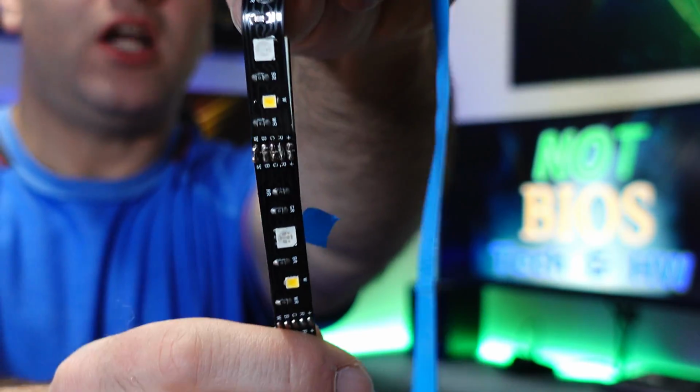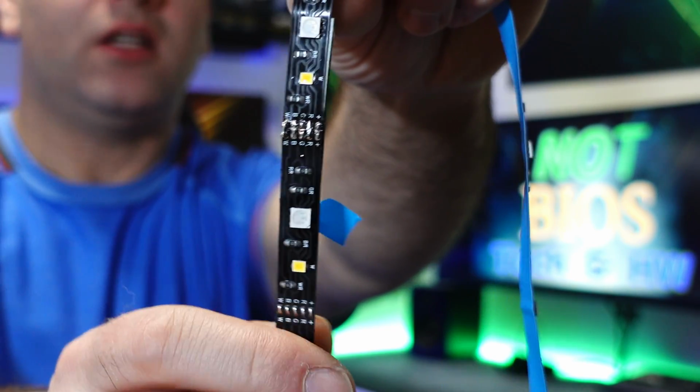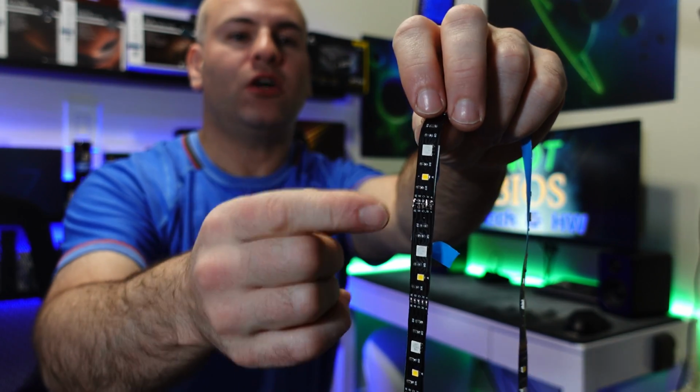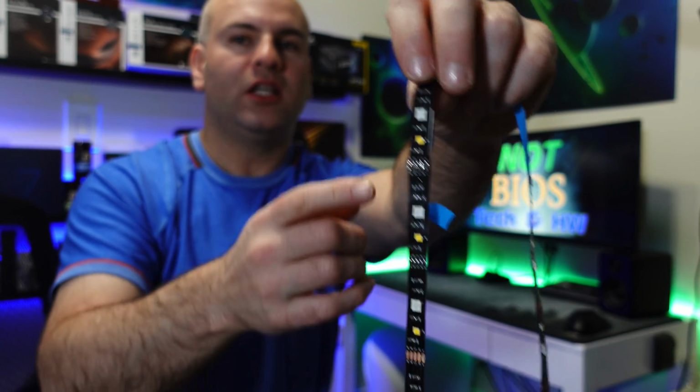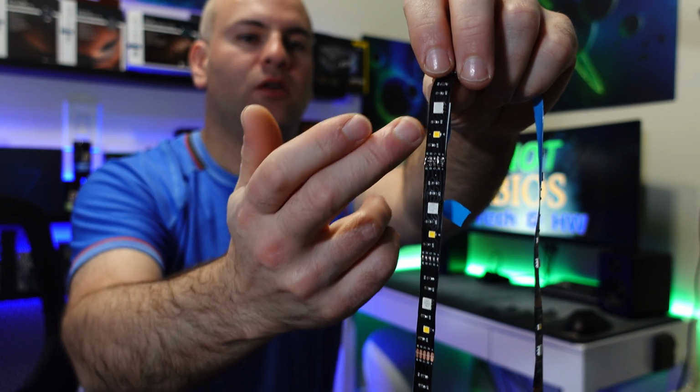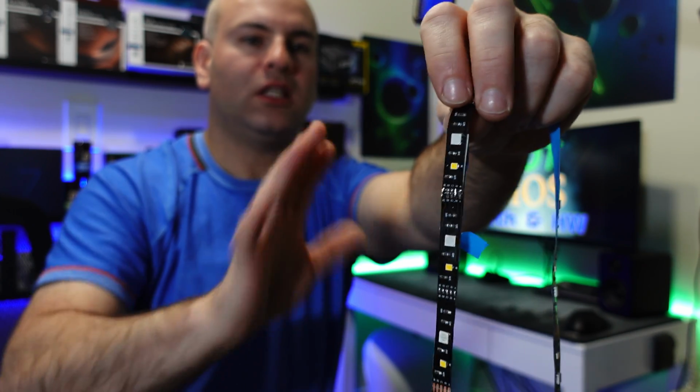This is not something I recommend doing. So I now have this soldered together. I recommend not doing it this way, because you're better off using proper connectors to connect this, because with soldering, if you bridge any of these together, it won't work. So polarity has to be the same, your plus with the plus, your white with the white on both sides, or else it doesn't work.